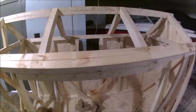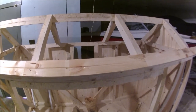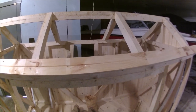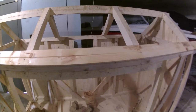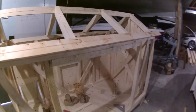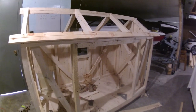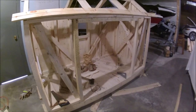And I'm putting lumber on the roof. I'll just put a thin underlay on top of that for now. Then again, them boards are going to dry out, and it's going to tear apart anything that I put on there. So it'll be next fall before I put a good felt on that, if I need it. Perhaps I don't even need it. Come on, guys, I'll show you along the way.